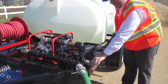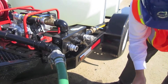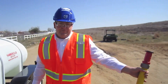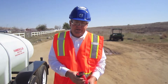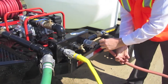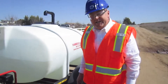You get a standard inch and a half cam lock — this is where you would connect your fire hose. Very easy to use, you just connect your fire hose, no tools necessary. You can go out from the trailer and use it for watering purposes, fire control, dust control, or cleaning any equipment. This is a standard three-quarter inch garden hose outlet — you simply hook your garden hose. Now you have watering capabilities, cleaning abilities, or anything else you should need.